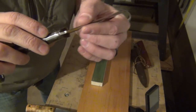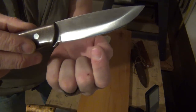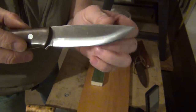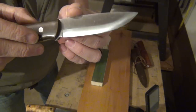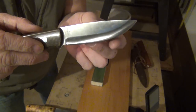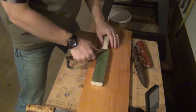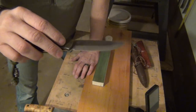If you're trying to figure out where you need to hit more or less, look at the blade — there's a really polished center section but not quite as polished near the heel and tip. You might do another set of 10 just on those sections and leave the well-polished part alone. It basically shows you where you've hit and where you haven't, so you can see right at the tip I haven't quite gotten it yet. Okay, so this is sharp now.